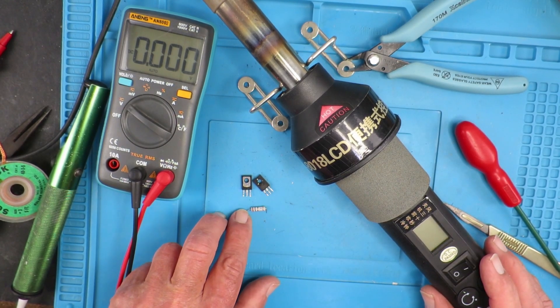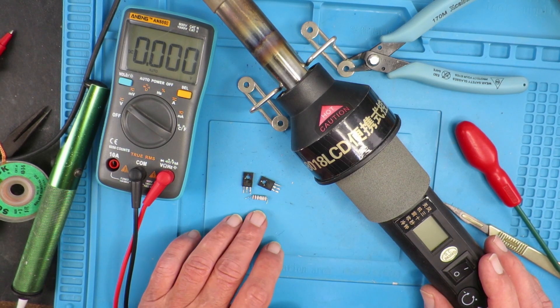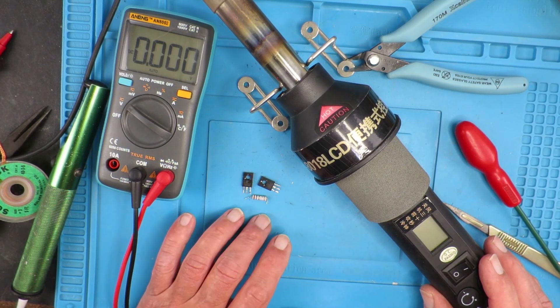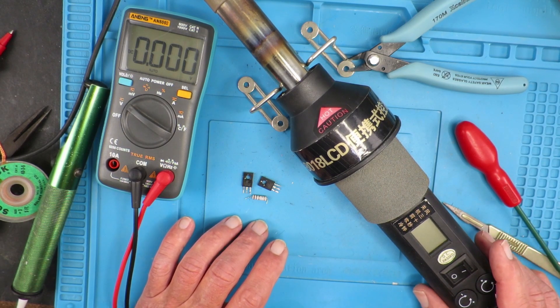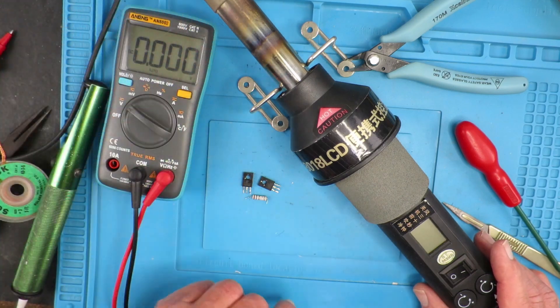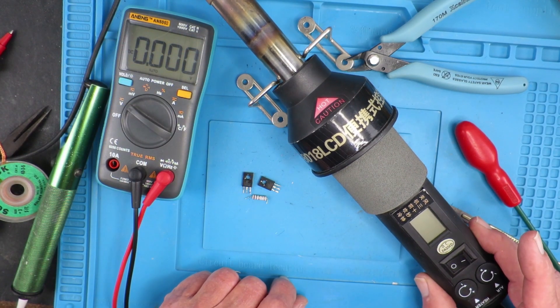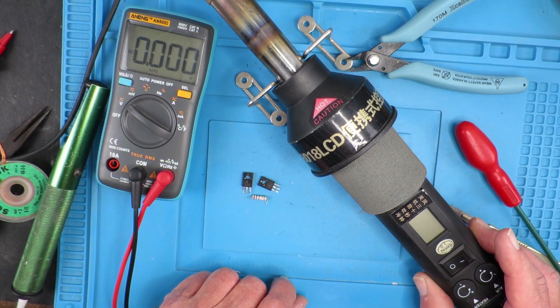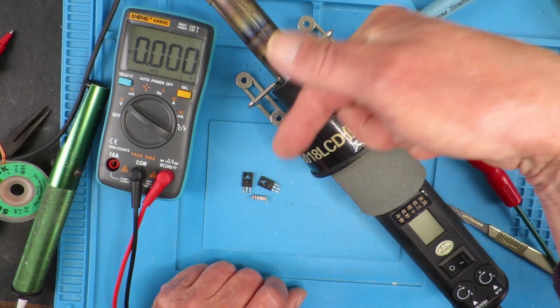So with the replacement of a burned out resistor and two transistors — all parts replaced from our scrap box — we've affected a decent repair. I can now get on and do what I wanted to do a few days ago, which is to replace a micro USB connector, so I'm going to be using this heat gun to desolder that. I've also taken the precaution of ordering a new element — I've used this gun regularly for three years now, so the writing's probably on the wall for the heating element. I hope you enjoyed that, and as always links down in the description.